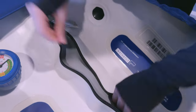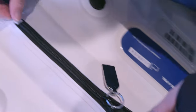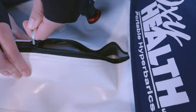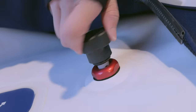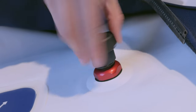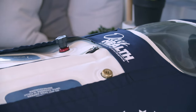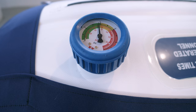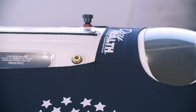Your chamber is now ready for use. Do familiarize yourself with its operation prior to the entry of any occupant. Practice the zipper closure and opening process, making sure both zippers are fully closed when pressurizing and fully open when depressurizing. Remember to close the pressure valve to begin inflation and that your compressor is on prior to occupant use. Your pressure gauge will let you know when you've reached pressure. We hope that you enjoy your chamber and its ease of use.